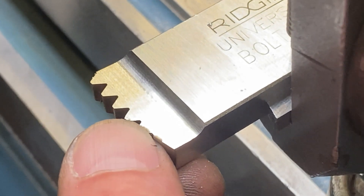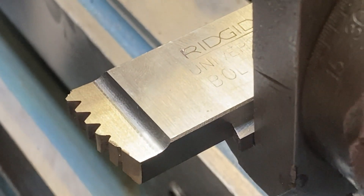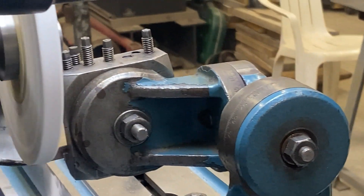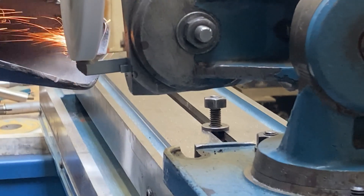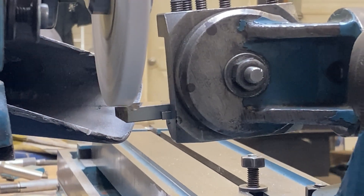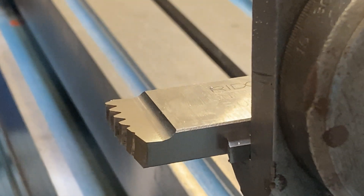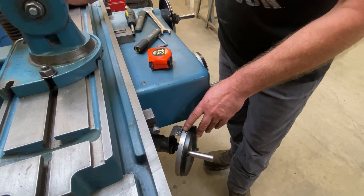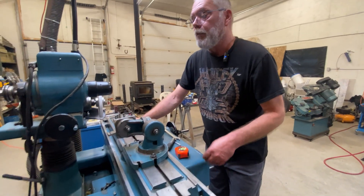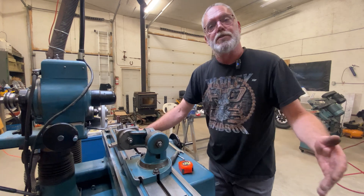As I'm freshening this face up, you can see the remnants still of the damage that I'm removing. I'm going to go until that's all gone - this bit here I want to get rid of. That's looking real good now. I've made a little mark here after I got all the damage cleaned up. My hope is that by bringing all four of them to this mark, they all clean up as nicely as this one did. In the event that one of them doesn't clean up, I'm going to have to go deeper on the whole set to keep them consistent.